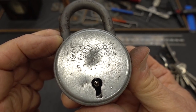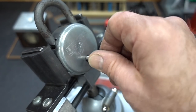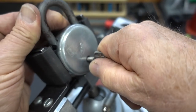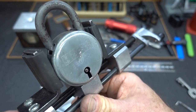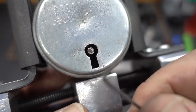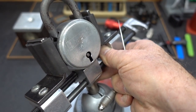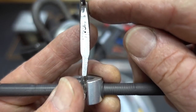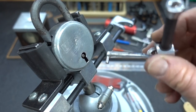Just a reminder - here's what the key looks like, and it does work: unlocked and locked. Here's what I came up with. There are two peculiarities with this lock: first, there's not a lot of room between the center post and the body of the lock, so I had to make the tensioner quite thin on the shaft. Second, because of the depth of this lock - 55 millimeters - I had to increase the depth of the hole for the post all the way back, which further weakens it.